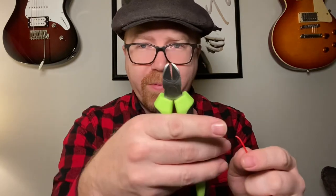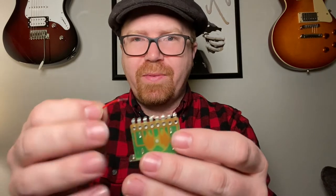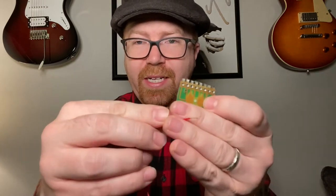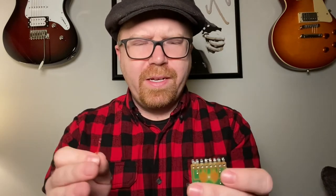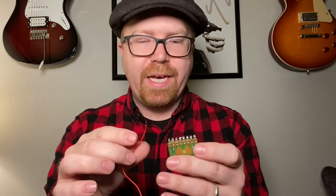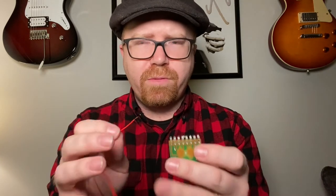If your wires are a little short, there's an easy fix. If you have wire strippers, that's the best tool. Or if you just have wire cutters or pliers, you can lightly crimp and then pull and get a nice stripped wire. You can extend any wire using extra wire — this came with the soldering kit. If you need to extend anything, just attach the extra wire and solder it to your existing wire. You don't want them touching — it'll short something out. You could put some shielding on it if you're worried, but as long as you keep them far enough apart, you should be fine.